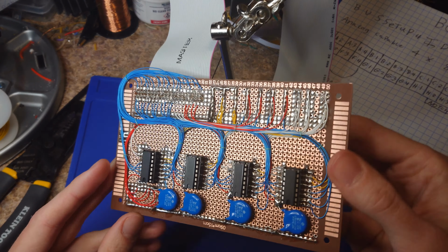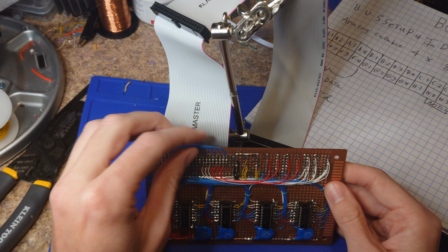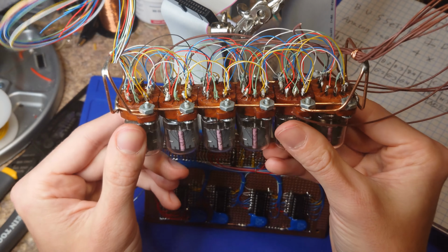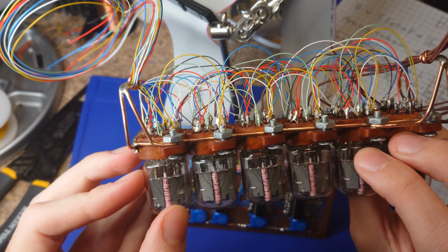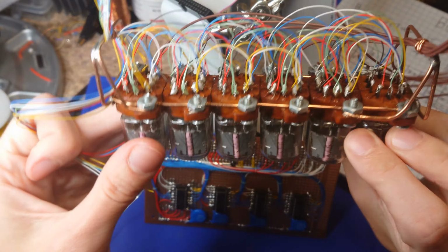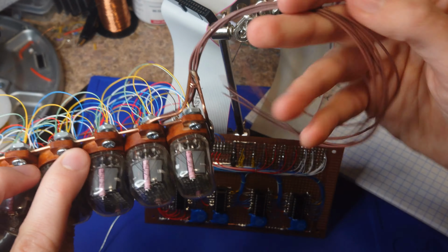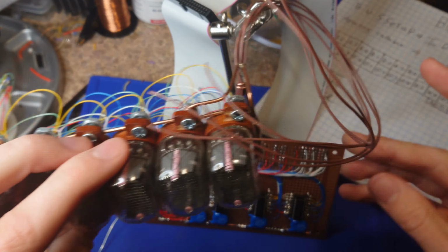That's pretty much it. We can't do much with this until I create a board that we can be driving something with. And as a little bit of foreshadowing for the next video, I have this lovely display soldered with, I think this is 16 gauge wire, pretty sure. And we have our outs all in parallel. Looks to be a bit of a mess, but that's what you get when you use sockets that aren't designed for PCB mount. And we have our anode select over here. So we'll drive these Nixies using this multiplexing board.